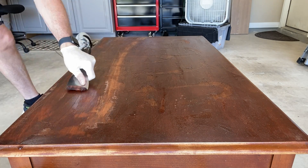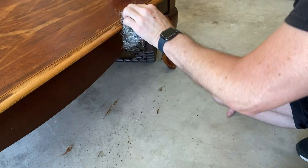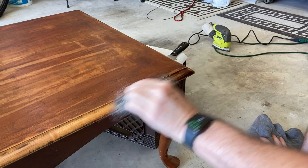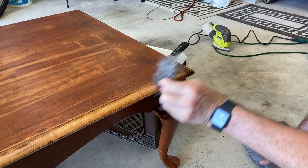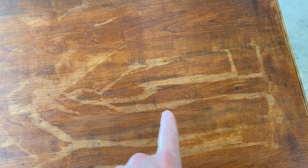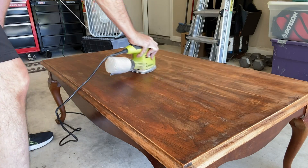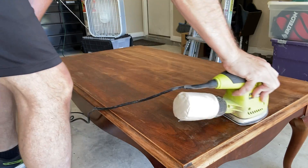This stuff is really really good - it's getting down to the wood. I ended up using a steel wool pad to get around that waterfall edge around the outside of the table, which worked really well because it was able to get into the entire groove and all the little nooks and crannies. I worked on this and tried to get all the finish off, but you can see that's the problem - where I had poured the stripper it sat a little too long and went further into the finish.